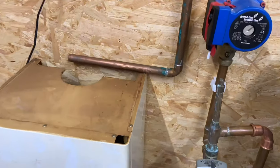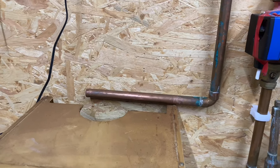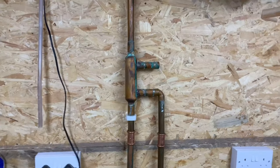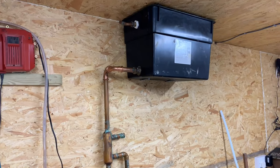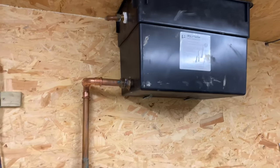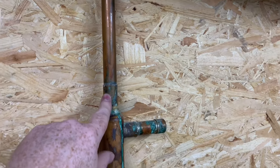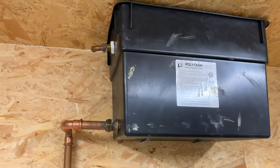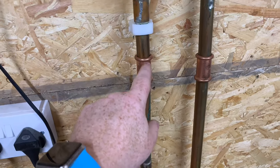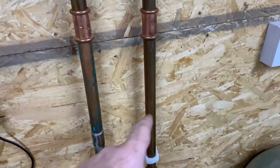I've put the flow in first to make it easier to understand. This is the flow pipe, which would be connected to the boiler with no other pipes off it, going all the way up to your airing cupboard. In this case we've got an air separator there, and then we've got the cold tank. This pipe here is the combined cold feed and expansion pipe connected to the cold water tank. Normally you'd have a separate cold feed and expansion pipe, the expansion going up about 450mm above the header tank.